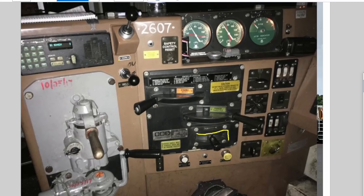You have your reverser here — that's actually your key for the locomotive. The reverser handle is removable and you need one to operate. Shove the handle in, throw the reverser forward for forward, backward for reverse. Next is the throttle, set to idle, with defined notches — only idle and then eight power notches, one through eight. You also have the dynamic braking handle, which we'll talk about more in the next level. It's a different kind of brake than air brakes, and it also has eight notches.